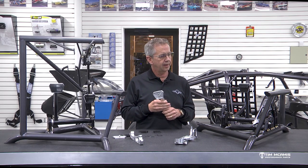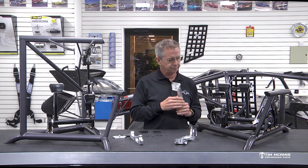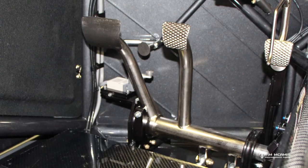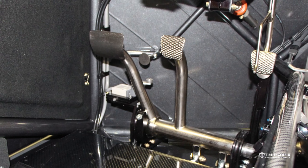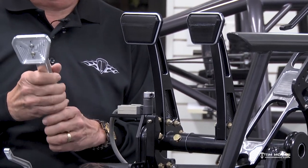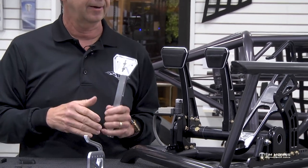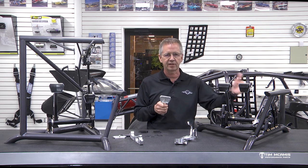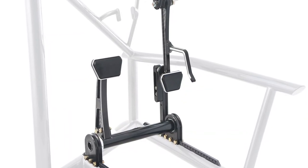This particular setup would be like a naturally aspirated car with a brake pedal only, no clutch. The only difference from a direct replacement — if you've got a car that already has a 4130 clutch pedal, the tube was at a slight angle so the mount could get the clutch pedal pad over farther. It may require some change on that end to get the pedals farther apart. We wanted them to be straight. If you already have this system with just a brake and throttle pedal, you can fit everything into that existing spot and change over to the billet set.